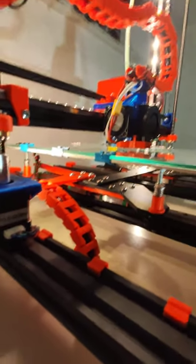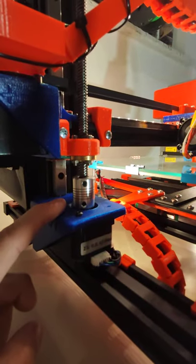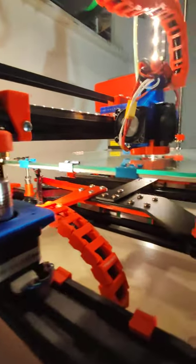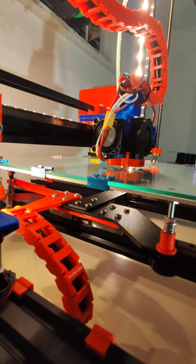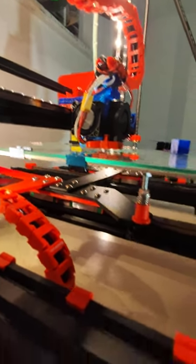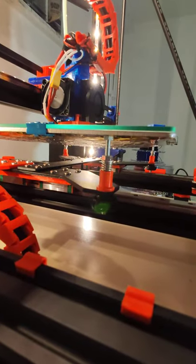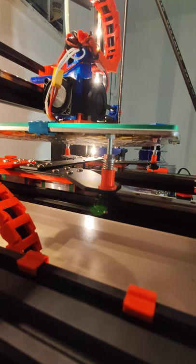Then we have a problem because this piece is a little higher. The hotend assembly is not as low as the original for the A8 Plus — you will need to raise it up a little bit. Just use longer screws and a nut.